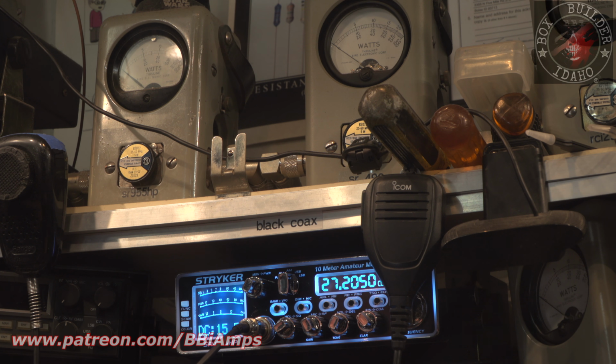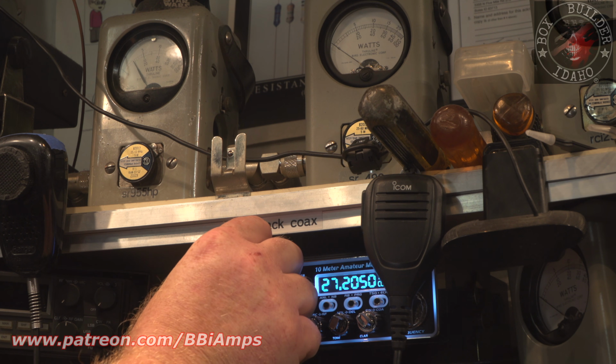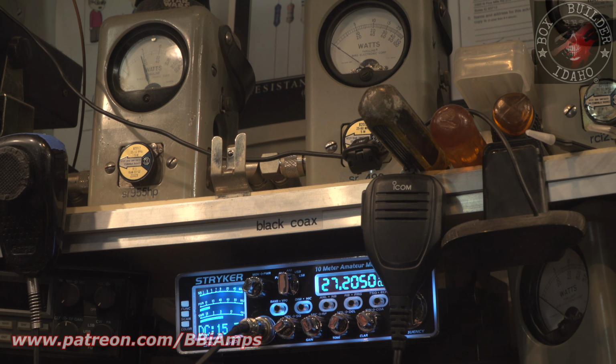And that clicking noise that you're hearing is because the input resonance of the circuit is falling out of resonance with what the keying transistor is able to get for RF coming in. So it's losing its ability to sniff because there's so much RF ping-ponging back and forth. So we'll readjust. That's 3/10 of a watt. Now watch what happens when we just turn our dead key up a little bit. And we readjust. Down goes our input SWR. So then we drive this. Hello.